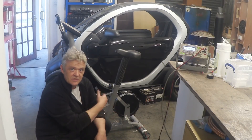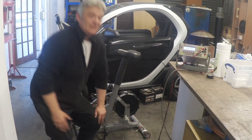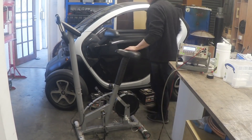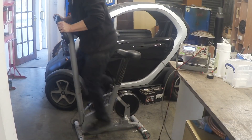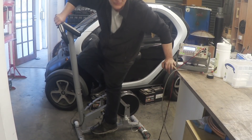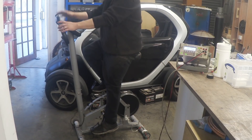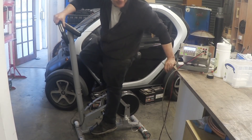There's the coil right there — it's where we put the other coil when we did this the first time round. To test whether this idea works I'm just going to jump on the bike and pedal it. I've put the meter here reading volts — hopefully you'll be able to see it. Whoa — 16 volts! I'm going to swap it to the amp reading now. I got 120 milliamps.